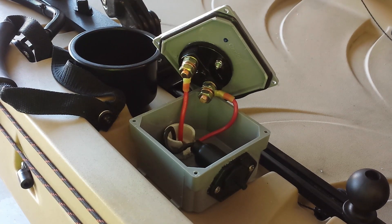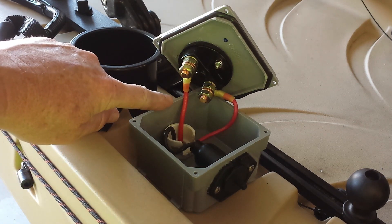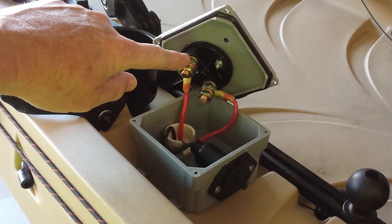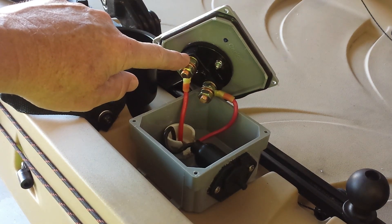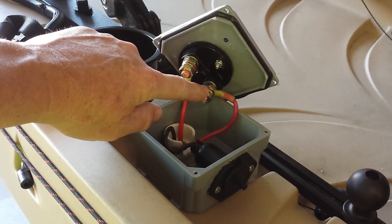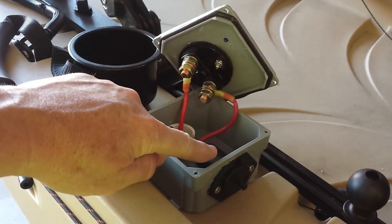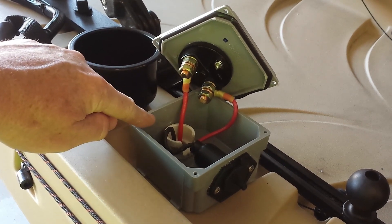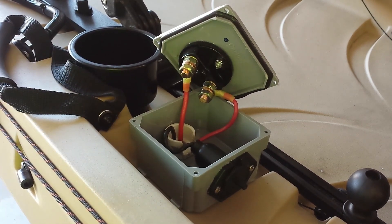This is an internal view of the junction box wiring. Coming from the positive 12 volts of the battery through the kayak is this connection to one side or post of the kill switch. The other post of the kill switch is connected to the positive lead of the 12 volt trolling motor socket. The negative lead of the socket is then run through the kayak and attached to the negative terminal of the battery. So the wiring is pretty simple.